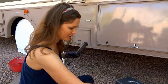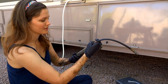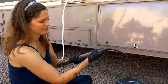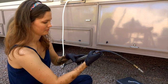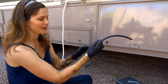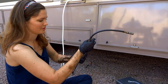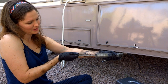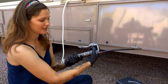Now that's open with the grease ready. You just take the top of the gun and screw it on. You might need to put a little bit of pressure to get this guy in, because he'll have a tendency to pop out. Then you just screw it in. Once you got it tight, if it's tight to push this back in it'll be hard because you seal off all the air. So once you get it tight, you just do one turn to open it so that you've got a little bit of airflow — that lets this guy go back in. I'm going to turn it to line the holes up, line the T up with the holes, and then push it in. And then don't forget to tighten this again.